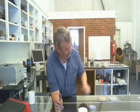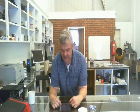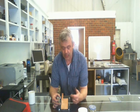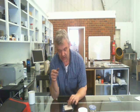Given that I'm going to do so much experimentation, I thought I'd build a solar test cell — and this is it. It's a piece of plastic with a copper plate glued on — just a bit of 6mm plastic, copper plate, and 6 screws. The plan is to take a piece of glass fibre tissue, fine grade, lay it over, drop the electrolyte on, and then using a bit of aluminium mesh over the top, put on the top plate and we'll have a solar cell to test. Then I'll test it, clean it, add a bit to the solution, test again, and so on.